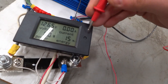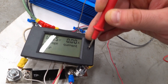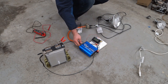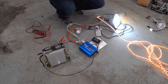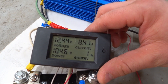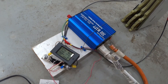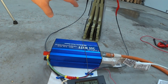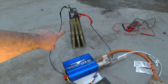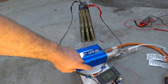We are at 104 watts — I wanted to hit 100 watts so this won't take forever. We have a little bit of sag: 12.43 volts right now. I'm going to stop at somewhere around 10 to 10.5 volts and find out how bad these cells are. I'm kind of expecting these batteries to die really quickly because they were drawn down so far and damaged — they're a little bit puffy — but we're going to find out. So far 50 watt-hours at 12.07 volts.